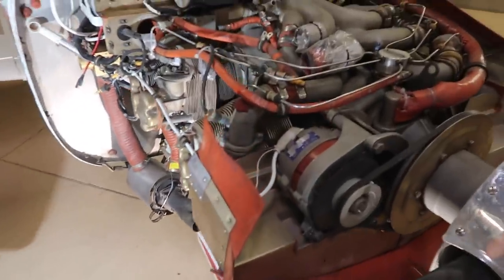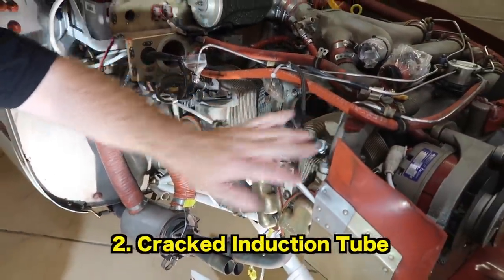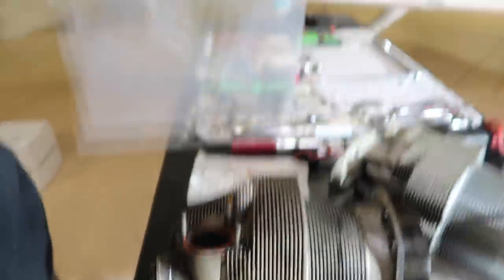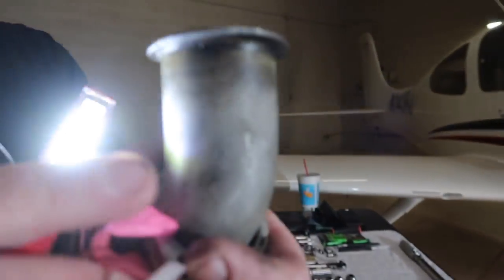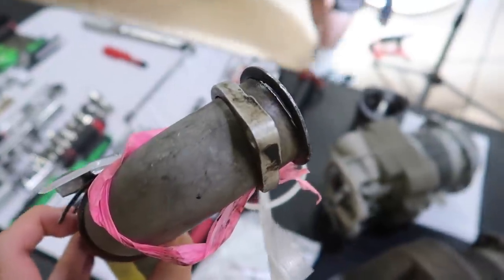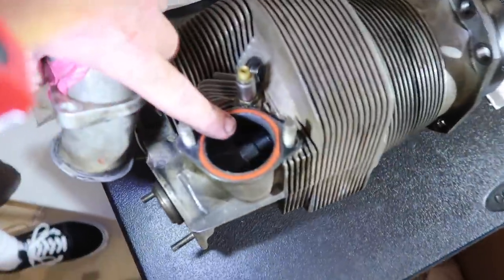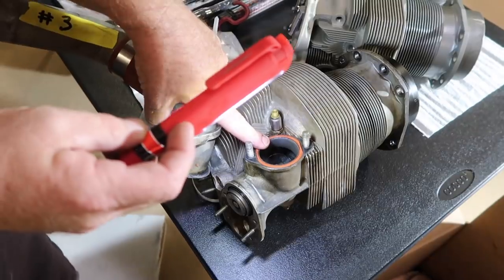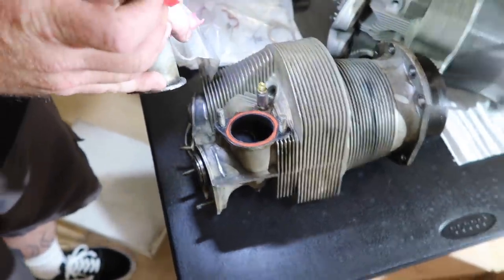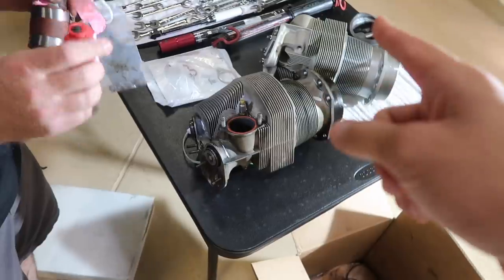What other big red flags need addressing? There's an induction tube — these sit on the cylinder like so, and you can see that's a very tight radius. Often they will crack, just like that — look at that. This goes directly to the intake port; right here is the fuel nozzle. Fuel and air do mix down in here, and you need the proper fuel mixture to stay cool. More fuel will absolutely keep a cylinder cooler.